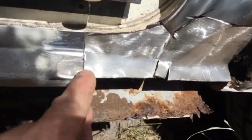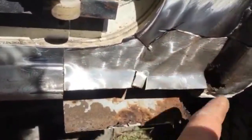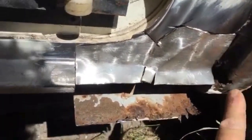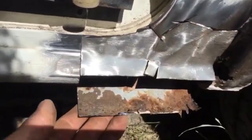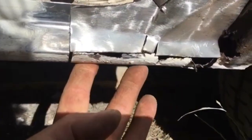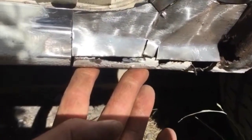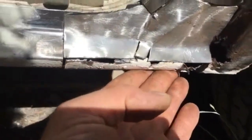As soon as I've started to weld around there, I can bang that bit in, pull any bits out. I'm not welding onto that at the moment because I've got to decide what I'm going to do with that, but at least I'll have that more awkward curve bit, and the rest is just flatter metal. And if you push that up, see that sits there almost perfect then. So I'll have to just put a curved bit on from underneath, but that's not a problem.